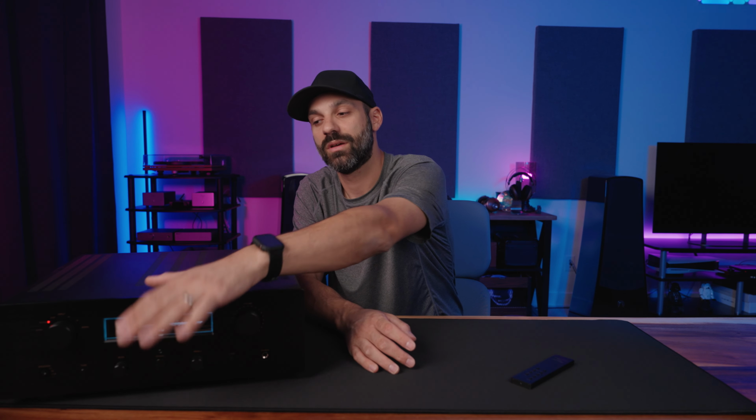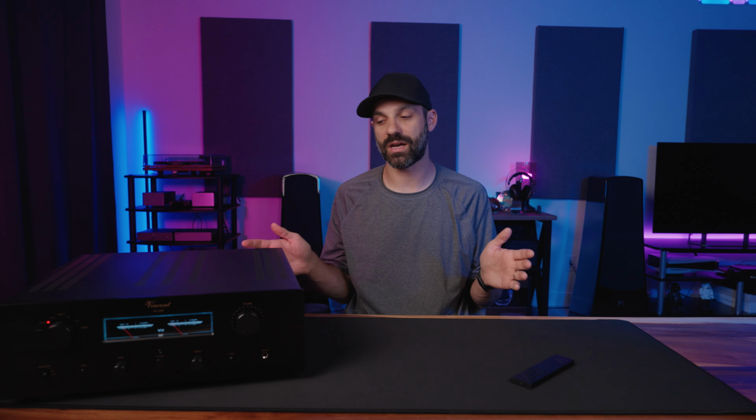However, another special feature of the SV-228 is the tone button. Enabling the tone will now give you the ability to adjust bass and treble via 2 separate dials. If you defeat tone or disable it, it bypasses that part of the board altogether, preserving the same frequency response of the analog signal coming in. It's basically leaving it untouched. So if you don't need EQ, make sure you leave the tone control off, and everything coming in through your analog connection can then be sent out to your speakers unscathed.